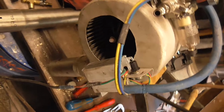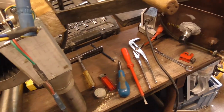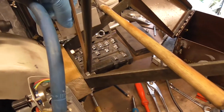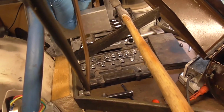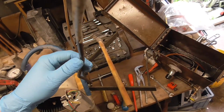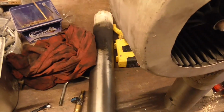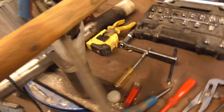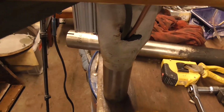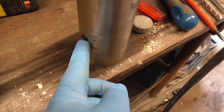So you'd normally see the fan mounted in that kind of orientation. The temperature block's going to go here. There's the block here. And that's going to mount on there like that, onto this tube. So the air pipe's still got to go on, because obviously I've still got quite a lot of pipe hanging out now. You can see these long pipes. Well, obviously these went all the way up this burner tube, and they feed in down the bottom through there, and the jet just fixes with a single fixing in the top of the pipe.